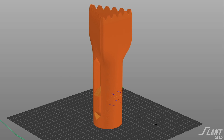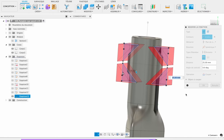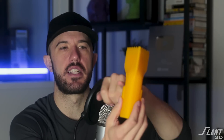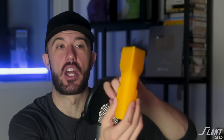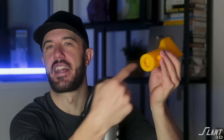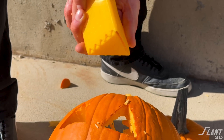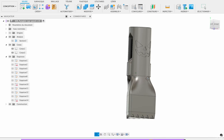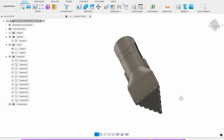There's no support anywhere inside this part. The side handles are designed as trapezoids so there are no overhangs or supports needed. If we were refining this, we might flatten out the bottom edge of the handles to make it easier to pull back when extracting from a pumpkin, since the angled design makes that harder. We would also probably add microstructures in the bottom so it becomes denser there without having to change infill settings, allowing use of a generic print-on-demand app.